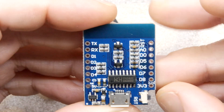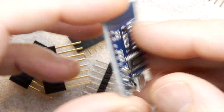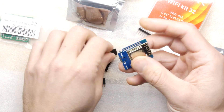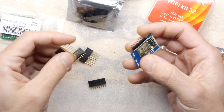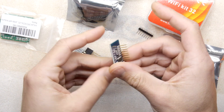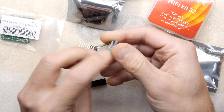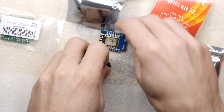It's the ESP12 chipset on a nice little diddy board that also has the reset and Arduino programming buttons ready to go. You do have a little bit of IO, though not too much, but because it's Arduino-compatible that makes it really useful for IoT projects. It comes with a nice selection of headers including extra-long ones, so you can stack them up for breadboarding projects and add Wi-Fi to your Arduino builds without much effort.